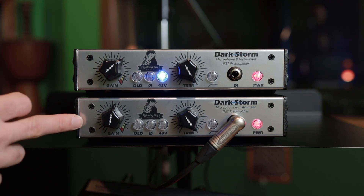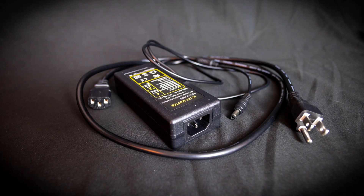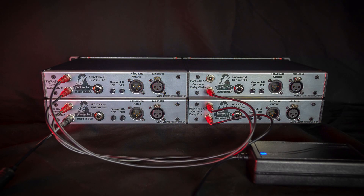The output of this Darkstorm is feeding into my Behringer PowerPlay headphone mixer so that I can monitor the microphone that I'm recording through with zero latency. The Darkstorm requires a 48 volt DC power adapter, which is sold separately. Up to eight Darkstorms and eight condenser microphones can be powered off a single power adapter using daisy chain power cables, which are available at lightningboyaudio.com.